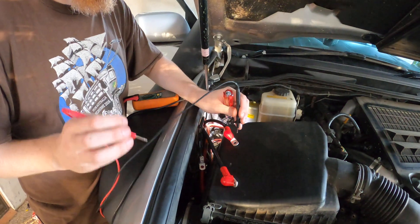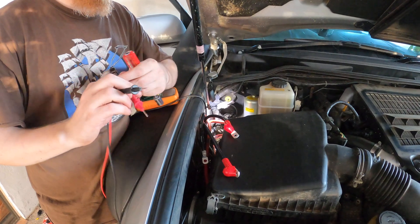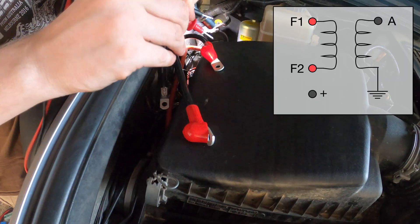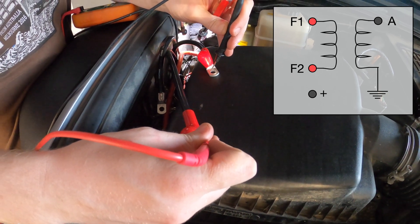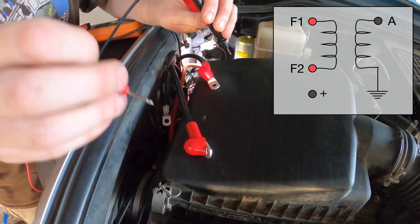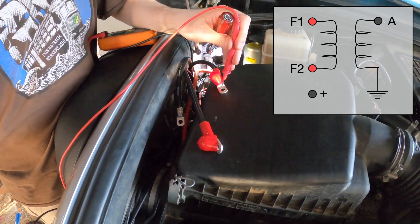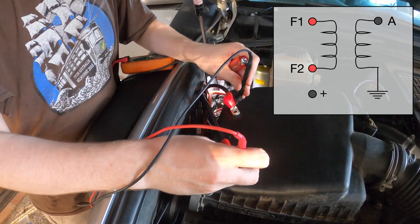The connections on the winch weren't labeled and we'd long since lost the original manual, so the wires were just connected any particular way around. The field windings will be the ones which are connected to each other both ways around. Sometimes there are suppression diodes in the winch, so check the wiring both ways because one way might go to ground. You'll see this goes to ground that way around, but not that way around — so those two are the field winding.